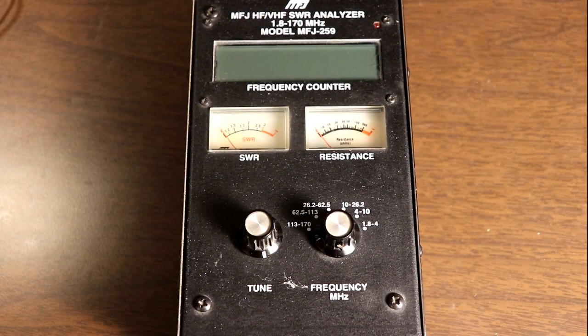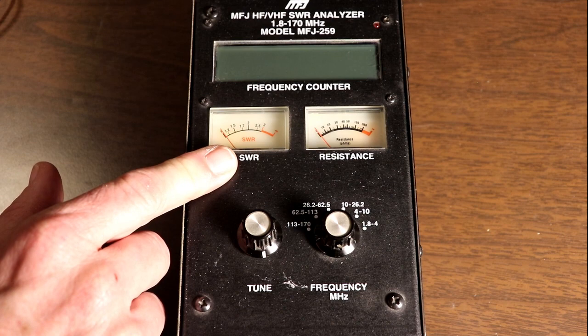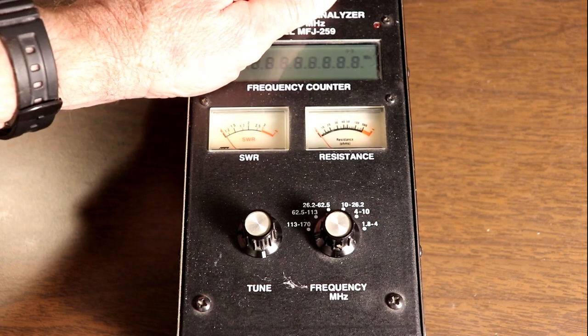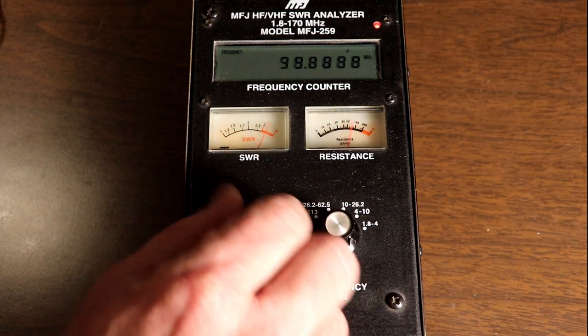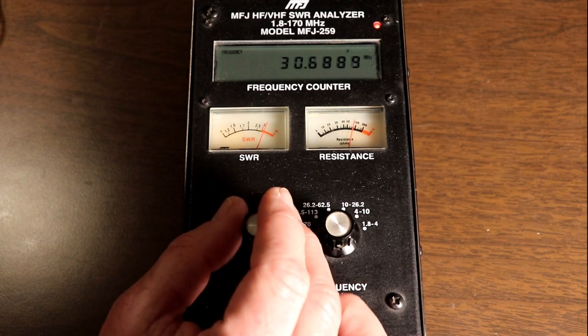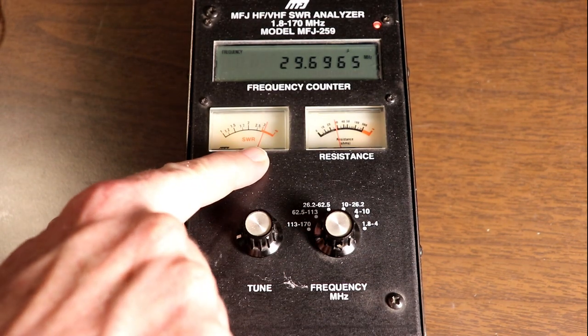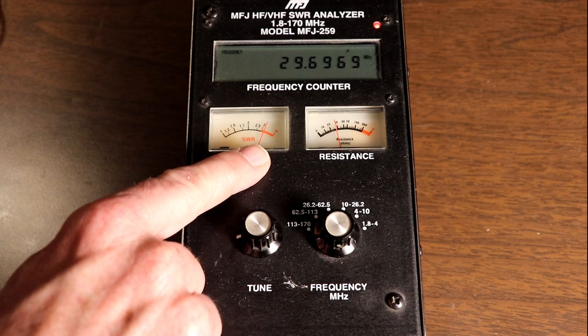Since I decided to do this video, I thought I would do a little bit of an SWR sweep on this antenna — I've never done that before. So I've got my trusty MFJ-259 analyzer out here, and I've got the antenna hooked up to it on a 12-volt power supply for a stable voltage. We're going to start up at the high end — we'll start at 10 meters. The top of the 10 meter band is 29.7 MHz, and the SWR is kind of high — let's call that a little over 3 to 1.